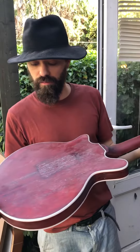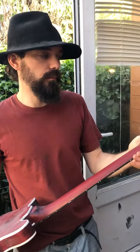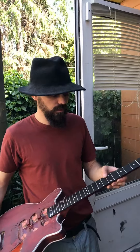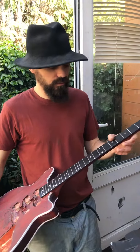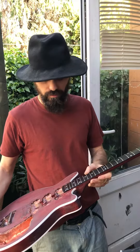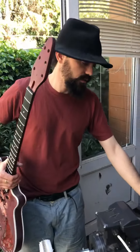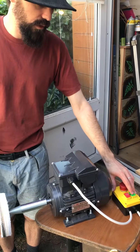The body's been sanded to 400 grit just to level it. Then I'm going to sand it to 1500 with soapy water. I've done in between the frets — scraped the board, done the frets, and fine sanded the board and the frets. Now we're going to use my new buffing wheel for the first time ever, and what better way to use it than on one of the original designs of a DIY guitar.